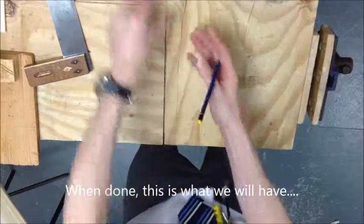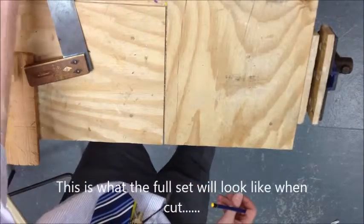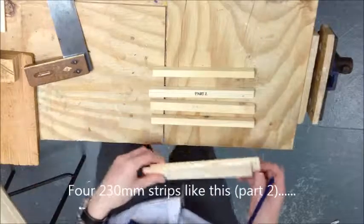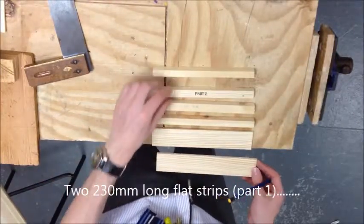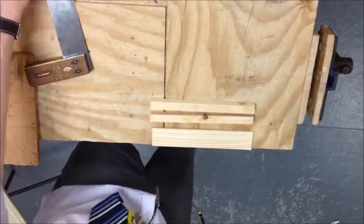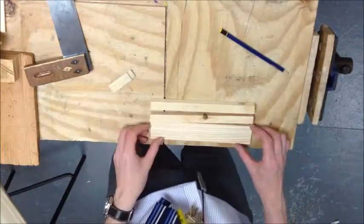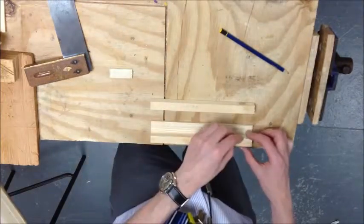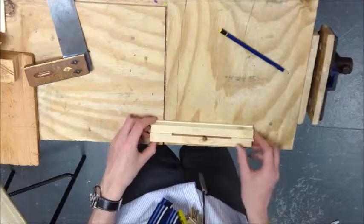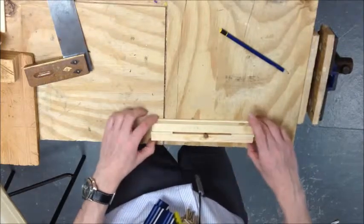So that is the marking out — marking out to achieve that. So you're going to have these separate pieces: these 230mm long, and these 230mm long. And what we're going to do is just show you an example. So this, this and this will give us one part of the clock — let's say the base. Two of these will give us enough to make the base of the clock. This is going to get glued and pinned together to make a little assembly something like this. That slot there is going to be for your glass and for your design, and the upright part will come out of there. We'll drill holes here and here. We'll also be learning about planing to remove this material and make it all smooth. So hopefully this means you understand the marking out and cutting instructions a bit better.